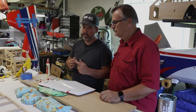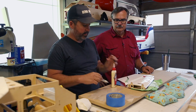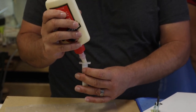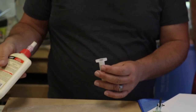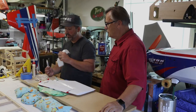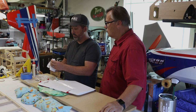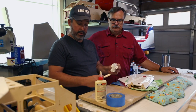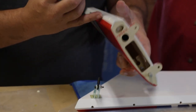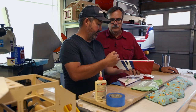Now we get our glue ready. TiteBond has been around for a while so it should still be good. Put a little bit into the syringe — you can get these on Amazon, link in the description. When you're loading the syringe, don't squeeze right away; let the air work its way to the top before you push the plunger in. Once the air bubble is out, you've got legitimate glue coming out. Squeeze a little bit into the hole — not a scientific amount — just enough so when you push the hinge in it pushes the glue down along the wall.